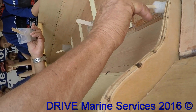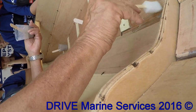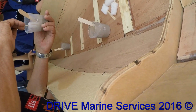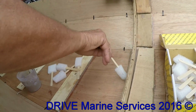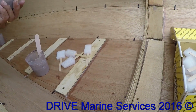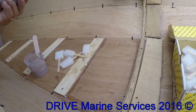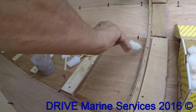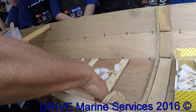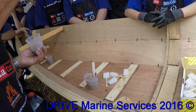Yep. Right. Now with your team effort, so you go and do the whole thing, and if it sticks up a bit like that, that's okay. You're going to do that. Now you're also going to go across here. And what we're doing is, this wood is very dry and it's a warm day, so this wood is going to go and suck up the first layer of glue. So we want to make sure that doesn't happen. And everywhere on your canoe, everywhere where one bit of ply hits another, I want to join with glue. So far so good? Yep.